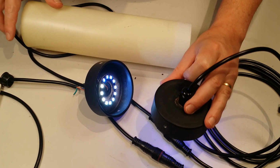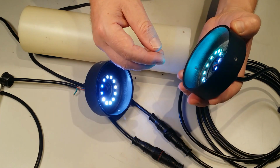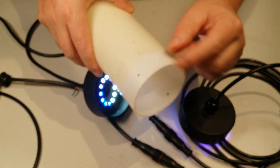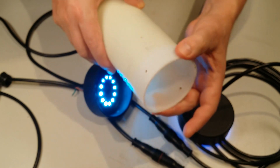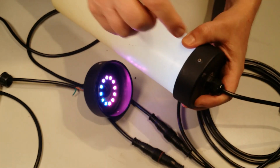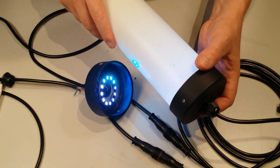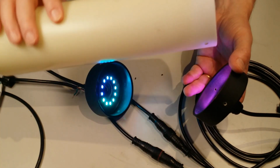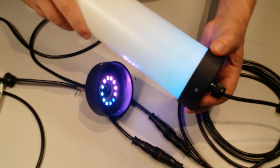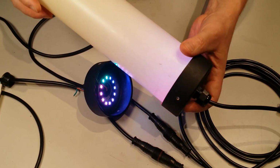And that's just a plumbing cap. I think it's a DWV 80mm cap. You've got to get the DWV one because that means it's 80mm on the inside, and I think these tubes are just slightly under 80, like 78 or 79 on the outside diameter. So they do fit without too much slop at all. And I just got a couple of screws that hold them together, and that way when the tint tubes invariably go discoloured after a few years, like this one has, sort of a bit of a mess on it now, discoloured from the sun, plus birds being all on it, things crawling all in it, I can just cut up a new piece of tint tube, poke it in there, drill the holes through, screw a new piece on, and it looks like brand new again.